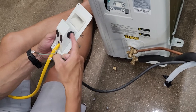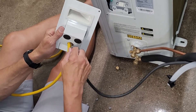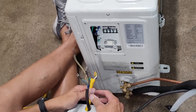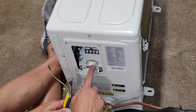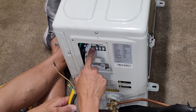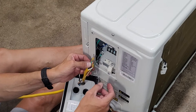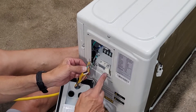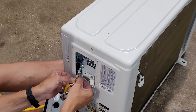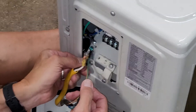Alternatively, you could feed either through this side port here, but we're only going to use this bottom one. Now we're all set up, and these wires are going to fit underneath this mount here, which keeps them from being pulled out away from the screws where they're going to be tied in. We took one of the screws of this flange out. Before mounting the screws in this base, in this channel here, we're going to mount the ground screws. There are two of them — one from the power cord, one from the power/control wire. The power/control wire has already been mounted.